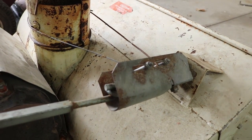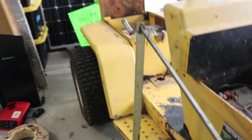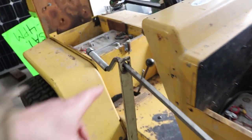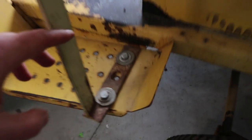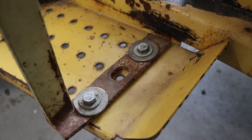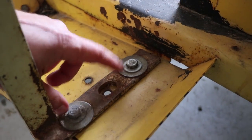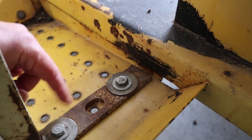Up here we've got the device to control the direction where the snow throws, and this is coming up to here. I got this bar which was bolted on with just a pair of 3/8 bolts going straight through. I actually had to ream out the holes in the footplate here just a little bit to fit those two bolts through.